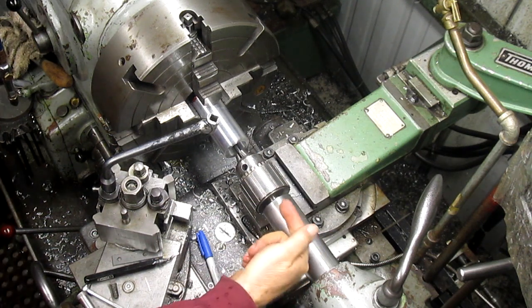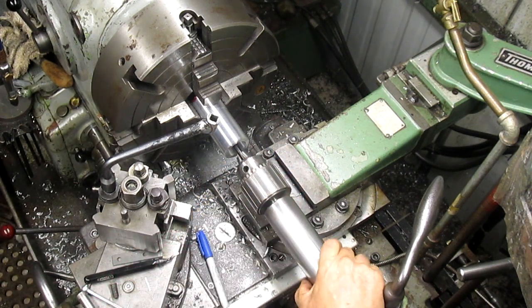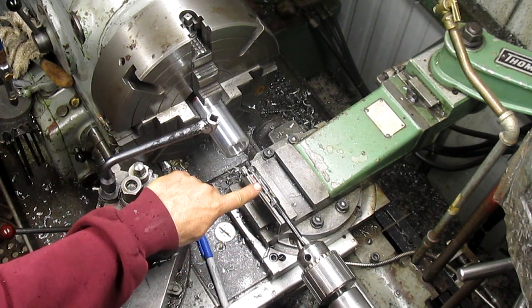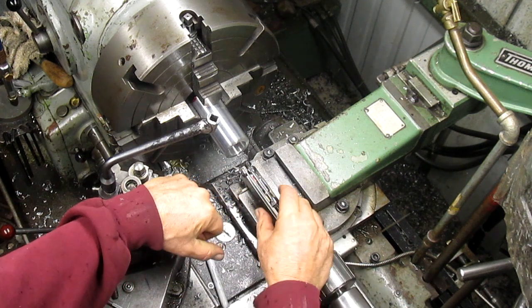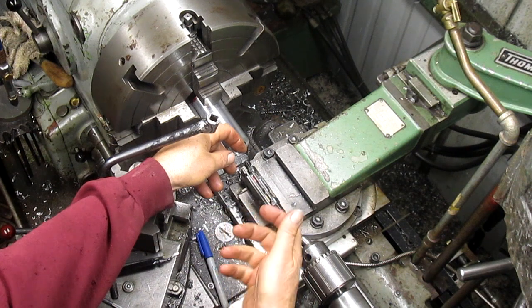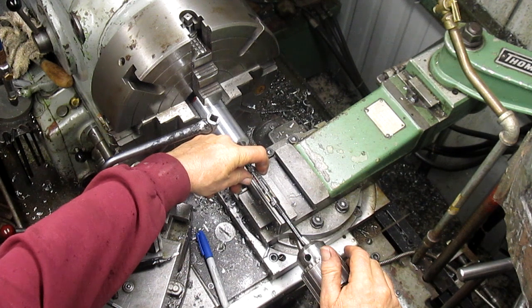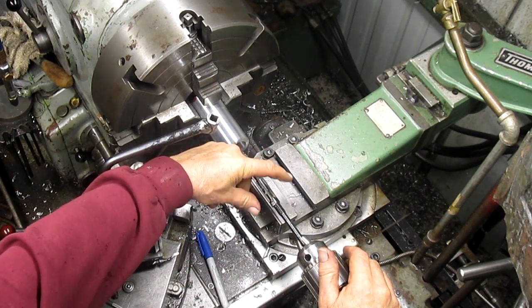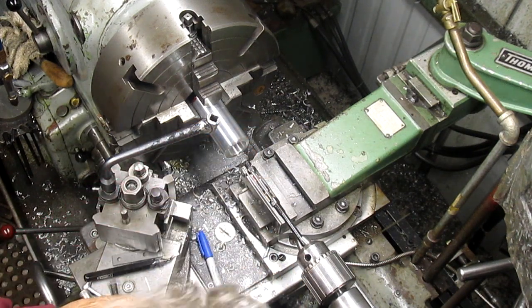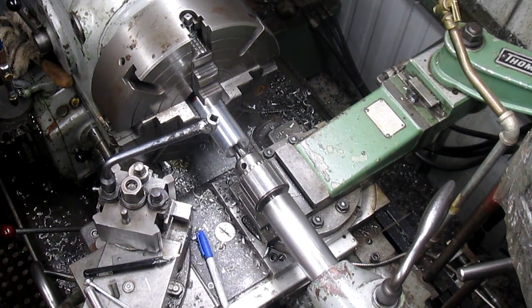And I'm traveling real slow because if you'll notice, and I'll go ahead and open this up, you notice there's only one place where the reamer actually works. It's right in this area right here, because this is a tapered reamer, which means they make it as a hand reamer, so they want this part to be smaller so that it tapers up to it, so that you can get it in the hole and get it kind of started, and then you just work your way in. Now, on the lathe, that's not necessary. All right, let's see.